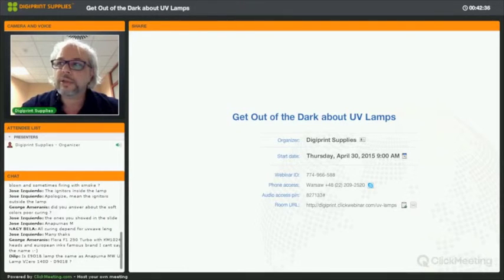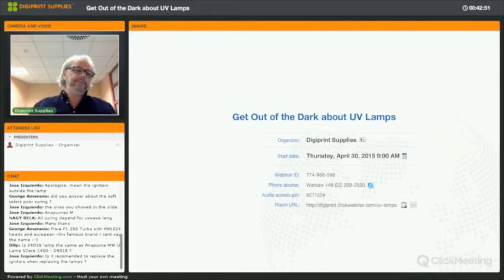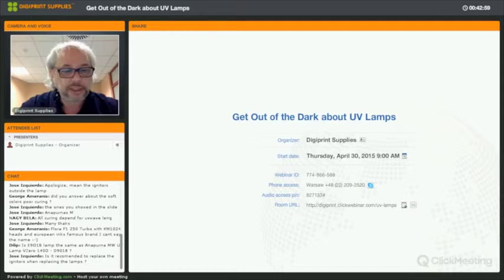well, soft tones will also create a layer that is less thick than the full tones, and maybe, just maybe, your lamp is just slightly too far away. Although it probably would have to be a considerable amount that your lamps are too high before you would start to notice that. So I would definitely take a look at the ink.